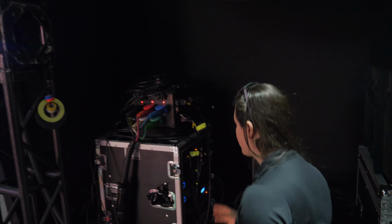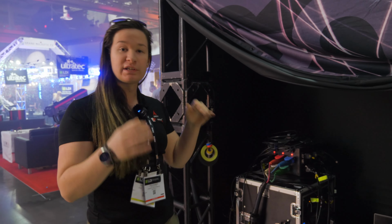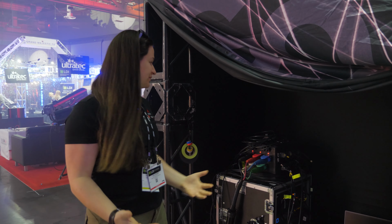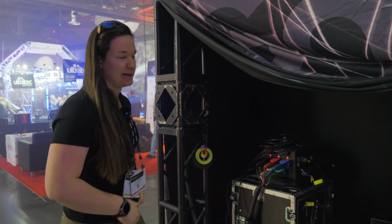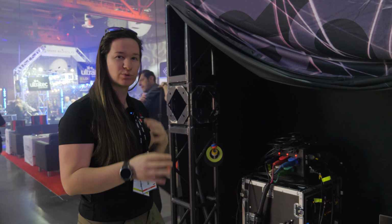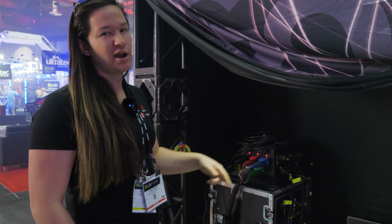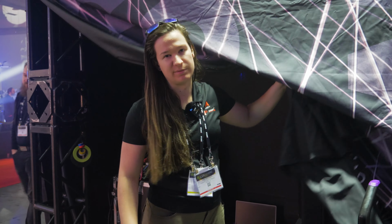From there, we just run those looms out to each set of lasers, and we usually do banks. If you looked at the Club Maxes, you looked at the Unities, we had like 4 and 4. So we tied those 4 into one run, and we tied another 4, and that gives us 4 circuits, 4 lines. It's easy to remember. So when you come back and look at the tags, you'll know exactly what you're looking at. Then we tie a couple of the big ones together, and we try to limit it so it's not more than 4 or 5 lasers in one line with the daisy chaining, just for power and data, which makes it a little bit nicer. I think the biggest chain we have is all those beam brushes on the bottom, which is 6 of them. I would try not to go over that. If I had to, I'd probably take that down from there.